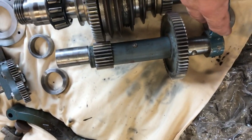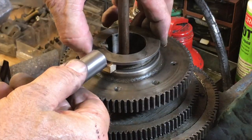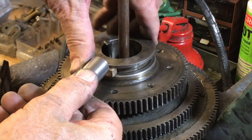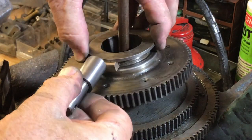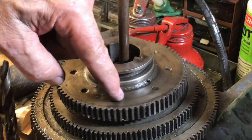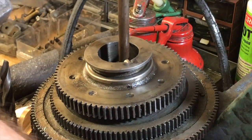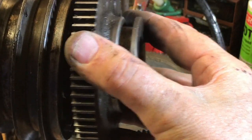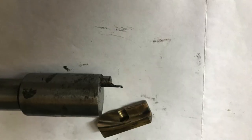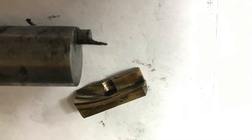This back gear lever is on a cam-shaped system. This pulley system is on the main spindle with a key, and when you turn the lever on the front, this bronze selector piece goes into that slot and as you turn it, it causes the gear wheel to move along the shaft. You can see how it would move in and out so that the pegs engage in the holes. If you turn the lever and pull the gear out a little bit, that disengages. This is what the piece looked like when I took it apart - completely worn out.